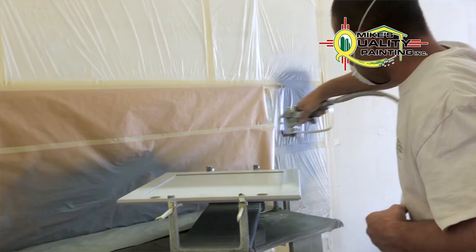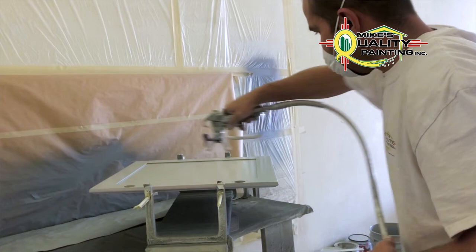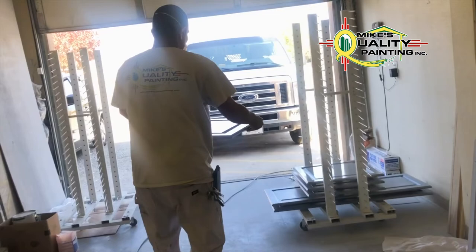After the primer goes on, we'll sand them. We'll apply several coats of acrylic urethane, so it's a modified acrylic. It's a really durable, hard finish, comes in a whole wide assortment of sheen, so everything from flat to gloss, and that's what happens at our shop.